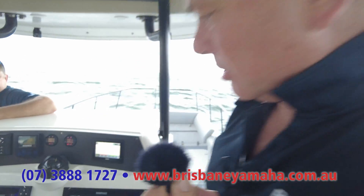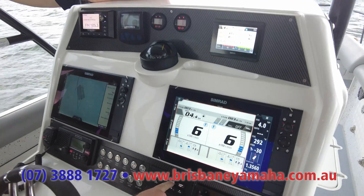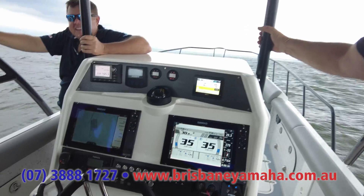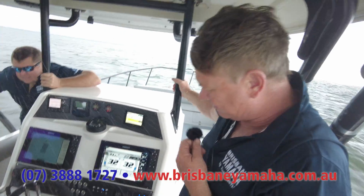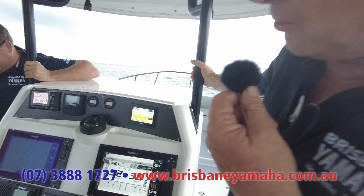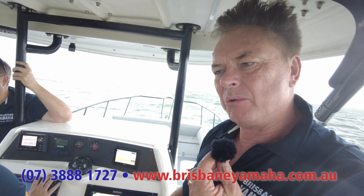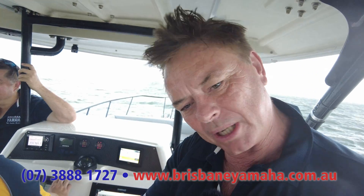On the autopilot, we've set a waypoint that we want to go to. We'll hold track point — and it's operational. So now we just accelerate and don't have to touch it. We've gone onto track point and increased the speed. With Simrad or any of the sounders, it'll get us straight there. We're only about a hundred metres off the mark. Don't touch anything — we're just off the mark, nearly there. It gets there and now the motors have just slowed down and stopped on the mark. With a Garmin it will actually hold on the mark, so you'll wake up on the fishing spot. For normal people, the boat will just slow up and stop here. Just a wonderful thing.